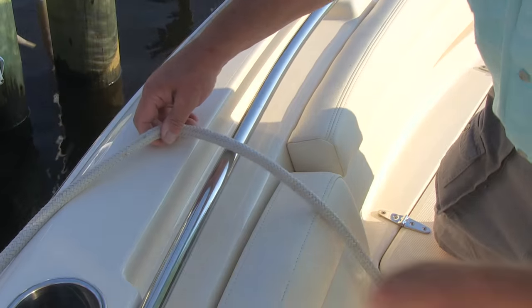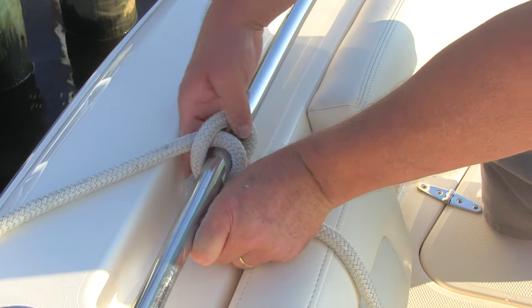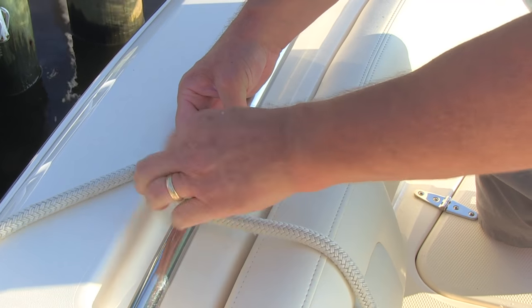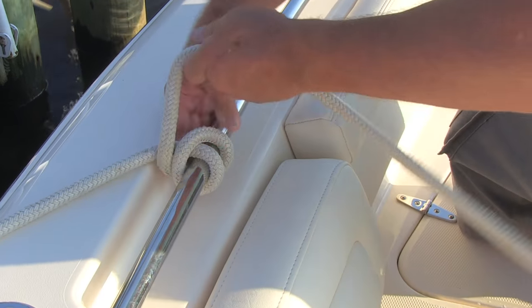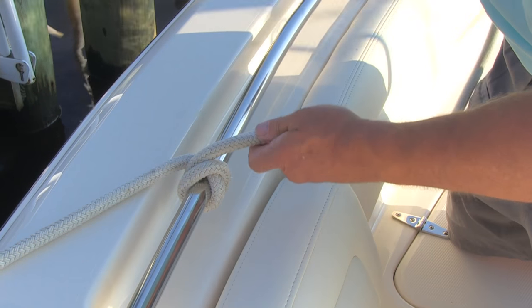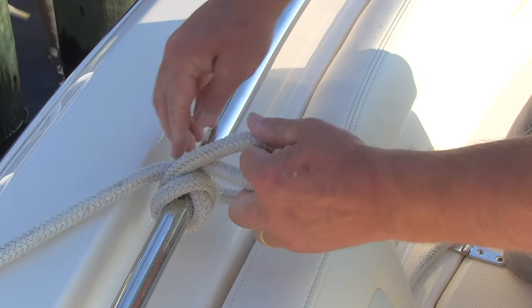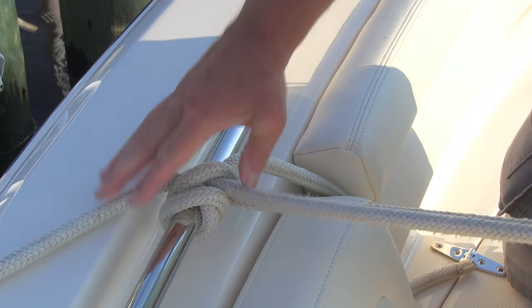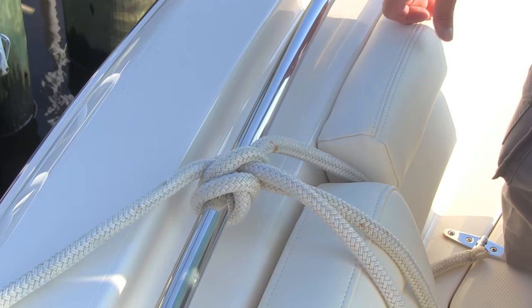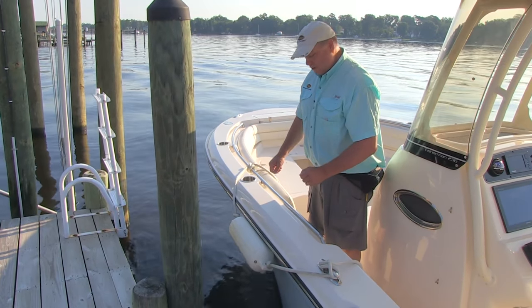The next handy thing I have forward is the hand railing. I'm going to put a rolling hitch on it — this knot is designed to cinch on itself to hold tight so it won't slip off. If you just use a clove hitch, it'll slip right down that smooth stainless pipe. I'll put a half hitch on top of that to secure it, then come back and check it again, because it might have moved around a little while I was tying those knots.